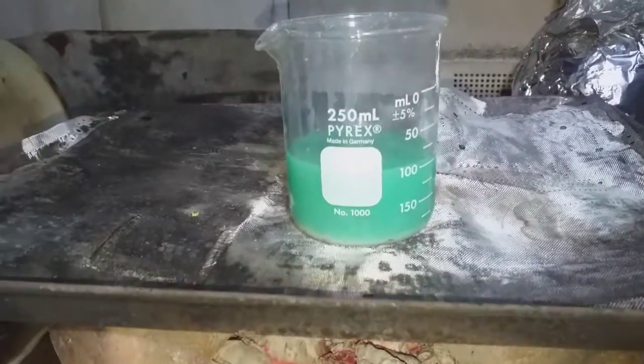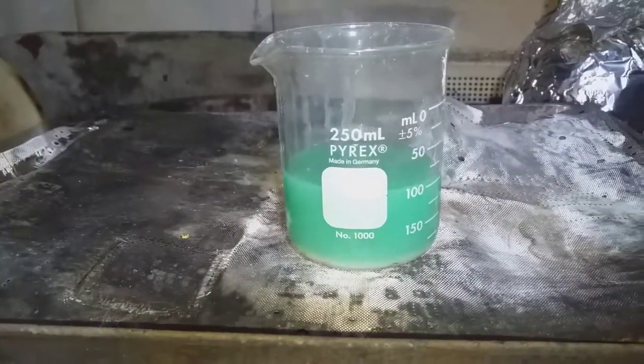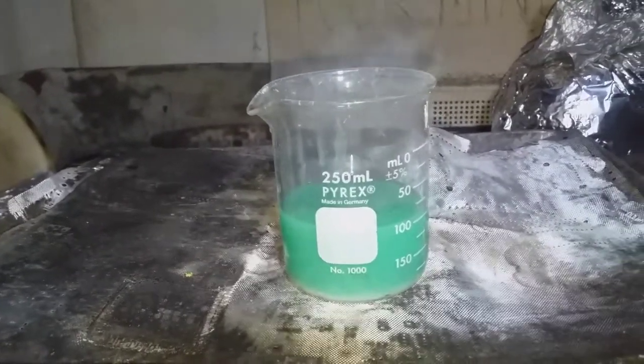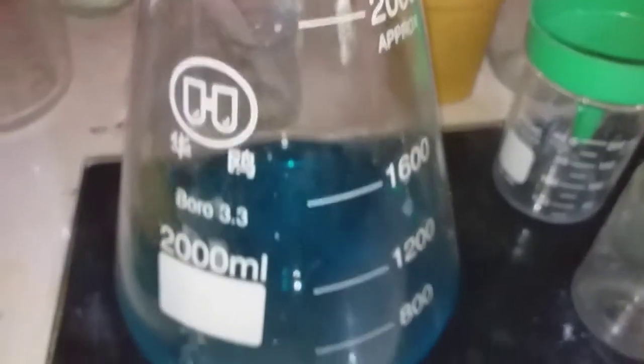And I think the digestion is almost complete, and I wonder why some of them are not in touch with nitric acid. I don't know what kind of material that is. So after this, we filter, capture some solid remain, and precipitate through copper. Filtering is almost done. As you can see, there's some fumes inside because of the excess of nitric acid. So it's done filtering, some solid captured from this solution. So let's take this, and this is our silver solution.